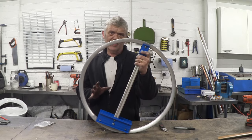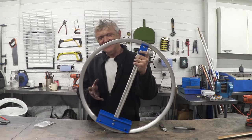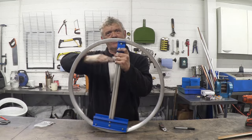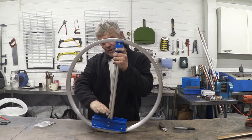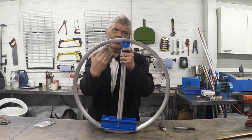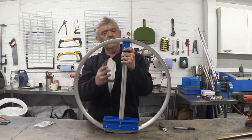If you think about it, it makes a lot of sense, because a motorcycle has a big engine going at high revs and you need an awful lot more bearings. A cycle — really, you don't need that much. Now if you were to put pressure here without a support bar, there's a chance the wheel would collapse, because rims really can't take it, particularly going over bumps. But if you actually apply the pressure at the bottom where the bottom roller is, you don't have that problem. This top part isn't supporting anything — it's just stopping the top wobbling around a little bit. All of the pressure is down here, and that's the bit that takes the force.